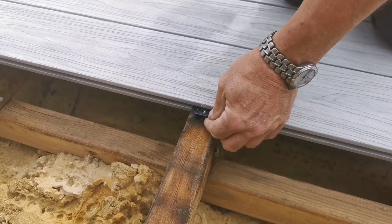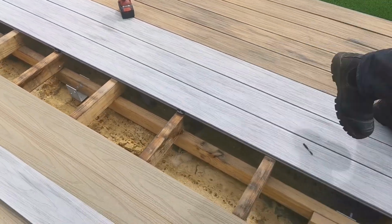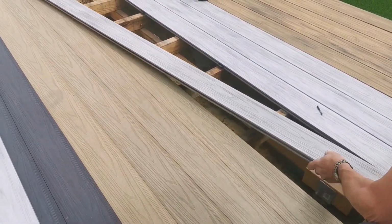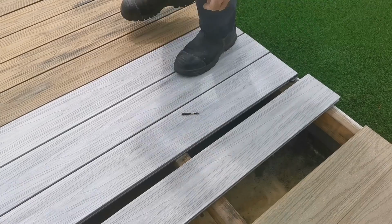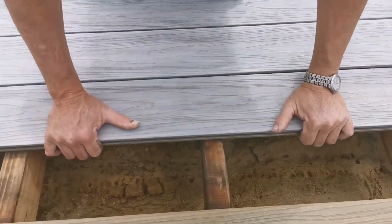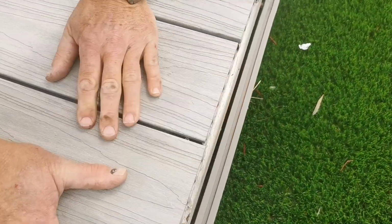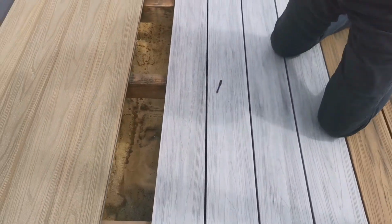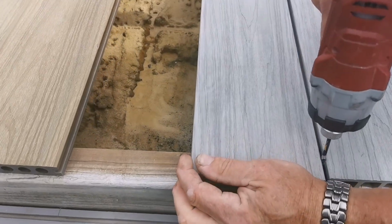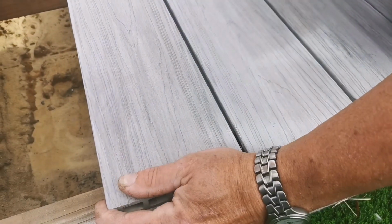And the impact driver bit will just go through. So now we present the next board to the clips. Basically, we're just trying to get the board in and onto the clip, leaving a gap for you to go down with your impact driver and tighten up those screws. So again, I've got it set on a pretty low torque. Can get between there without scratching the boards. And then just a final bit of tension.